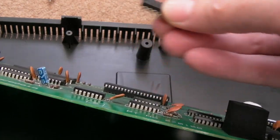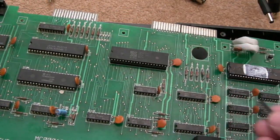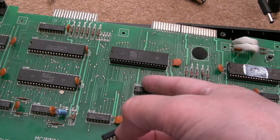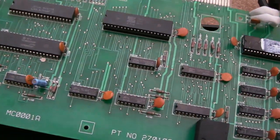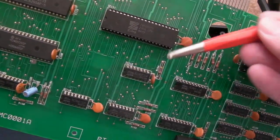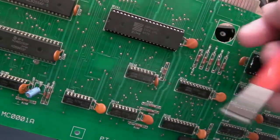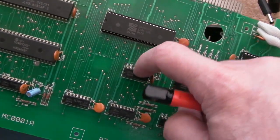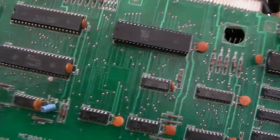So, yeah, piggyback technique. Some people don't like this. Some people go, well, it doesn't catch everything. But when you've got a high impedance signal like that on a logic gate, that will work. That is definitely the problem though, because I even cleaned up with the fiberglass pen a minute ago here, and just measured again. Nothing at all. The gate there is not outputting at all, so that is the issue.